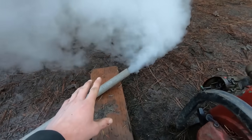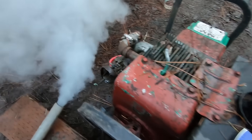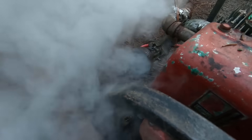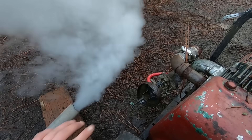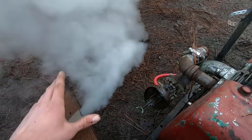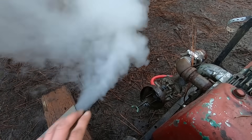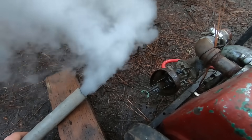We've got flammable gas — now it's the moment you've all been waiting for. We're going to try to start this generator by blowing the gas into the intake of the carburetor. Ordinarily you'd have a pipe straight into the carburetor with a T and another valve on the side, so you can adjust the gas and airflow from the outside to get a perfect stoichiometry for the engine to run its best off this gas — sort of like a primary carburetor. But for now we're just going to do it this way and that should work.